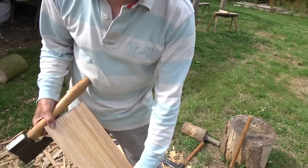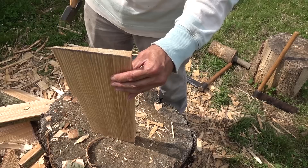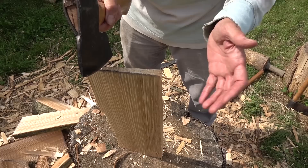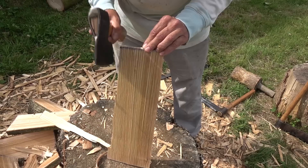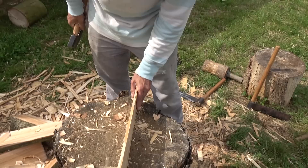If someone didn't have a side axe you can still do it, but it's much more difficult. Now there's the wedge shape — it's too thin at this end. You're looking to achieve about half an inch; sawn shingles are much thinner than that. So I take that away. The trick now is to keep the two pieces parallel and straight, with your sight line going down. And we've kept that — beautiful. Now there's a little bit of a bulge on that side, so I stand the shingle up and see where the slightest plane is.